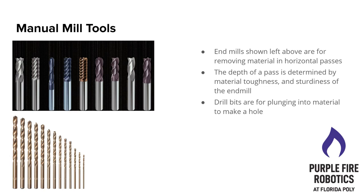You can also use this mill for drilling — it is again accurate to within a thousandth of an inch for very high precision parts. What's interesting is when you use this machine, you realize that drill bits are not really that straight; they tend to be a little bent and not perfect. So it's common to plunge a hole with a drill bit and then make it larger with an end mill that's the right size.